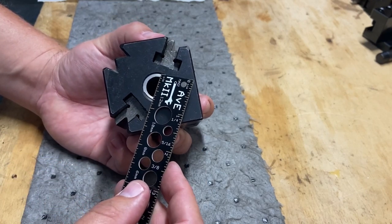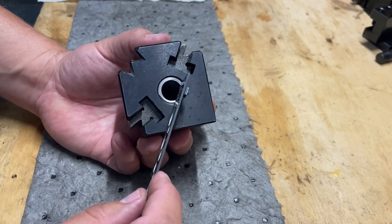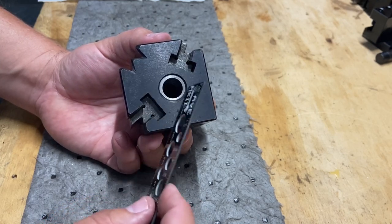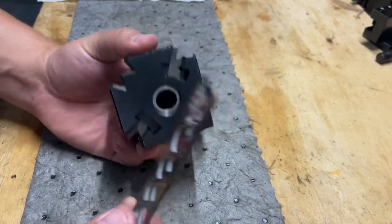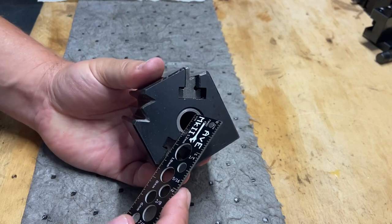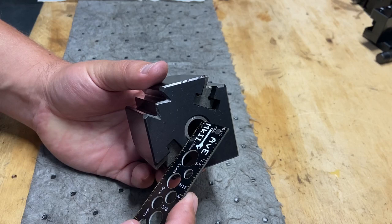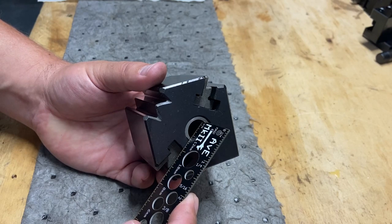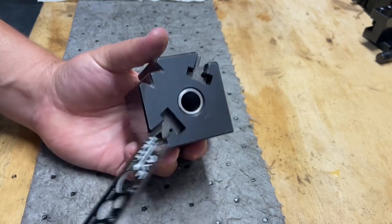Let's go ahead and measure that for you too. Looks like 3/4 of an inch, undersized, just shy, is the opening of the steel portion. And then of course your bushing, or I believe it's this inner piece, its bore is just over 1/2 inch, 5/8, sorry. About 5/8.